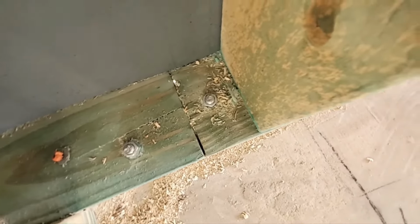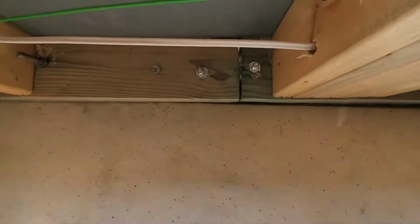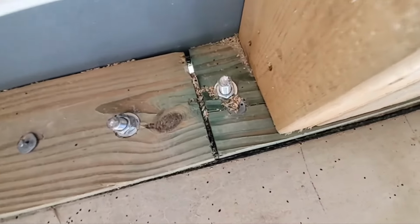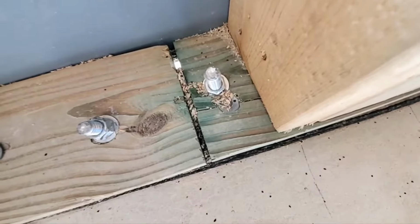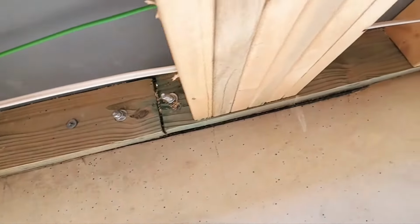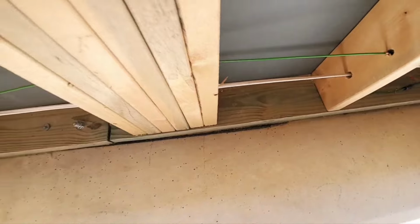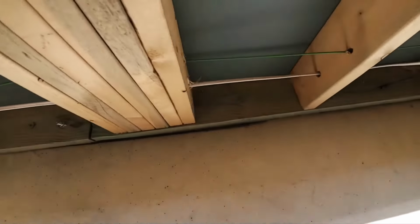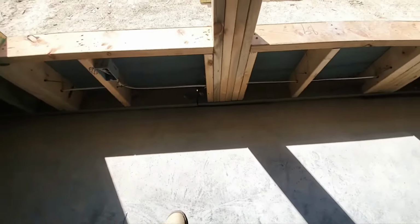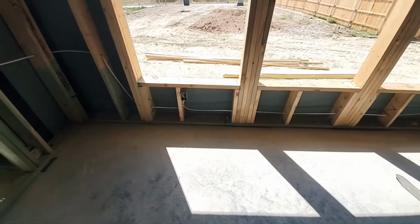are a little bit close to the end, and indeed, I'm seeing that. So, it should be 7 widths of that anchor bolt. So, a half inch, that would be 3.5 inches from the edge. Now, where are you going to put it? You've got more than 12 inches before you hit a space where you could drill another one. So, I would say probably the best thing to do is just to put another one in on this side. That'll give you 2 within, you know, 14 inches of that end, which is probably fine. More than enough.